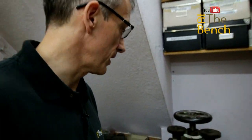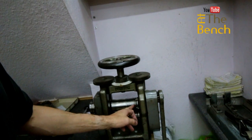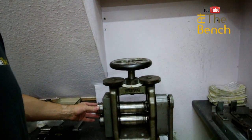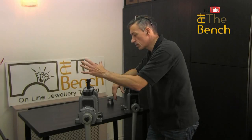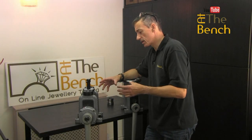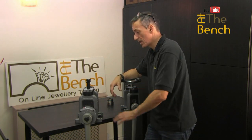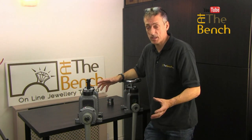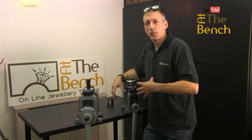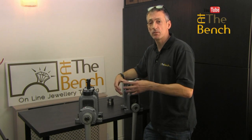So that is the other type of mill — we have the flats here, the V-grooves here, and the extension rolls on the side as well. I've had that for a long, long time and it's absolutely brilliant. As you can see, there are lots of other considerations when buying a rolling mill — not just direct drive or gearbox, but extension rollers, flats, V-grooves, and D-section grooves to think about. When I started, I wanted to melt down scrap gold and silver and make my own sheet, wire, D-section and so forth.